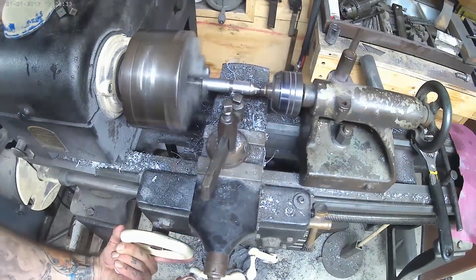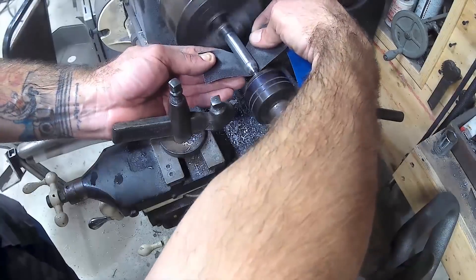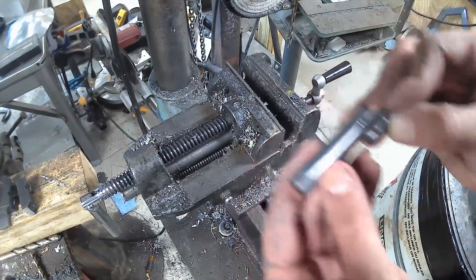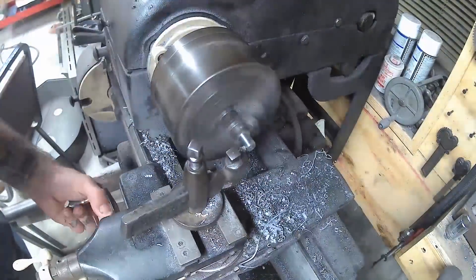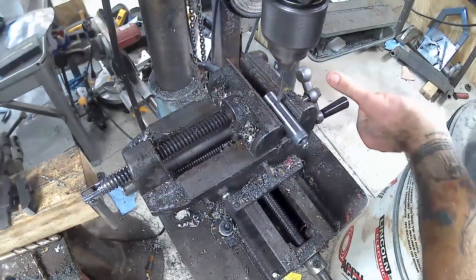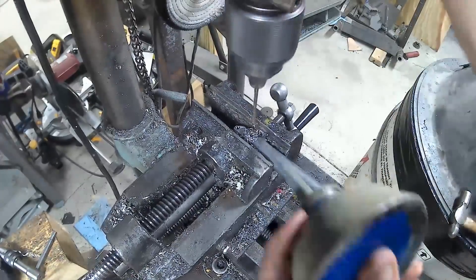Here I'm just cleaning up the barrel, the body, giving a little shape to it. Here I have the tip made — that's going to be our anvil that our ball bearing hammer is going to hit against. We're going to need to put a hole in this so it can breathe. We're turning down the back side of the tip until our barrel fits nice and snug. Now that we know how deep the tip goes, we can figure out where we need to put our air hole, because we're going to need it to allow that ball bearing to run back and forth — otherwise it'll create a vacuum. Then we're marking and drilling for our set screw with the tip in place.